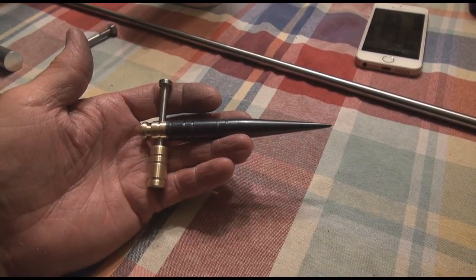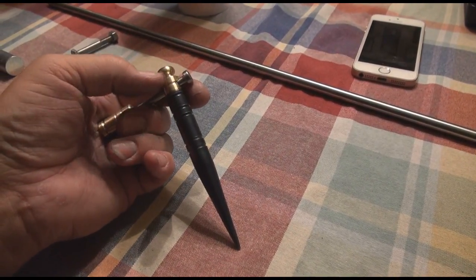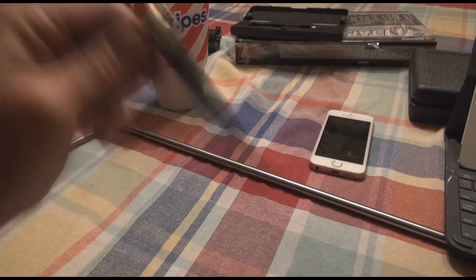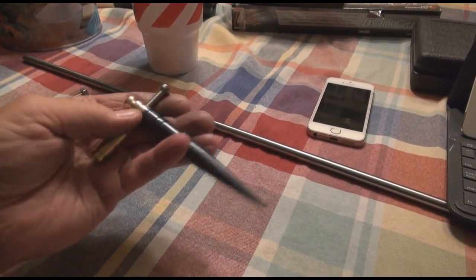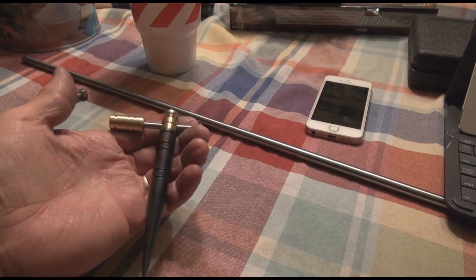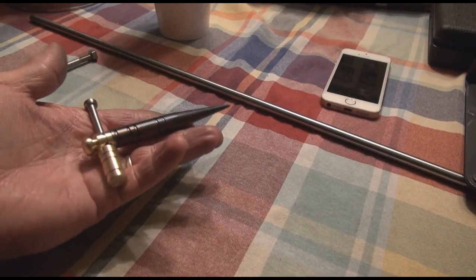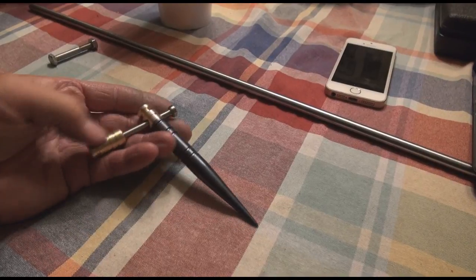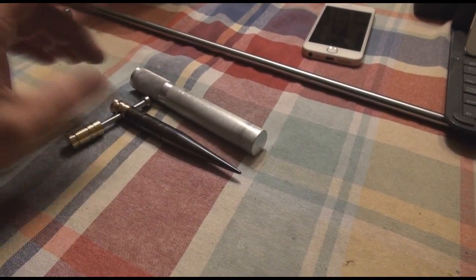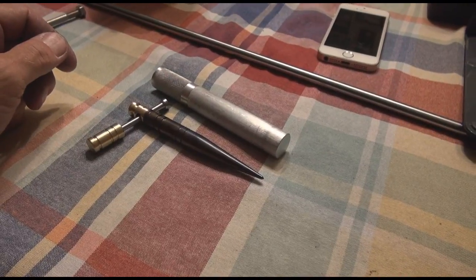Hopefully you can see I put a hole through this right here, and I used a reamer to make it smooth inside. That was so I could fit this special pin through it. I had to make the hole a little bit bigger because the threads are a larger diameter than the shaft. This is the complete marlin spike with the special attachment — you can attach string in this notch and if you twist it, it will start to braid it into a twine or into a rope, by spinning it like this. The T-handle also — if you want self-defense, you can also grip it that way as well. I have to put this on a lanyard through here and maybe drill a hole through this bead. I might make another part: hollow this out and have this inside with a threaded cap.